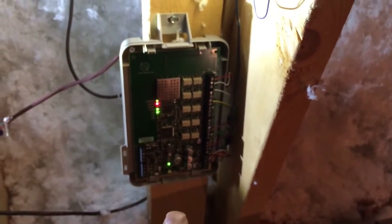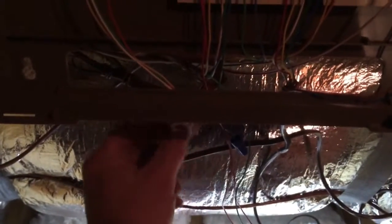There are no options, no bells and whistles — you just get what you get. What I wanted was: when the humidistat called from the Prestige IAQ stat saying it wanted humidity, I wanted both zone one and zone two to open. Since I had no option of setting dip switches on the board, I installed a relay to fix that problem. I essentially just added a relay to the zone panel. Let me get the light where you can see it.